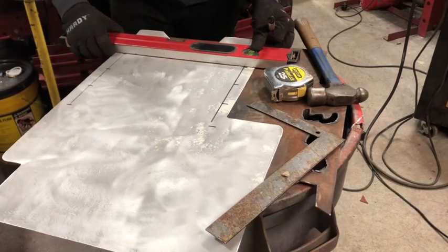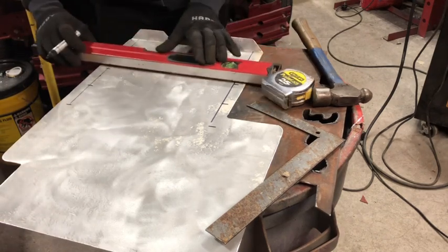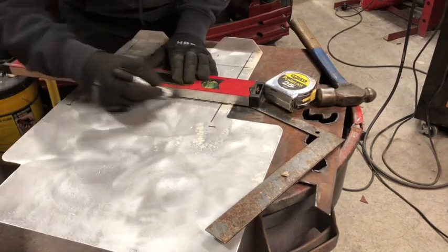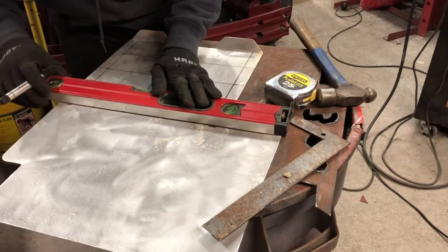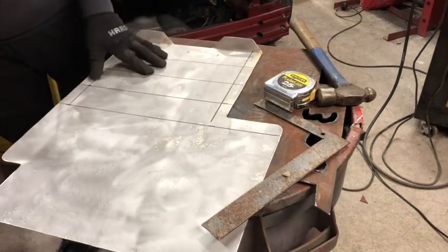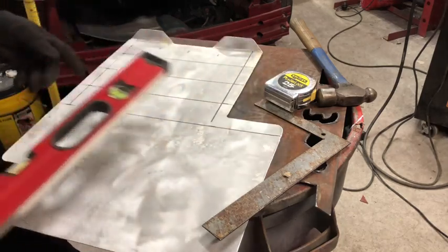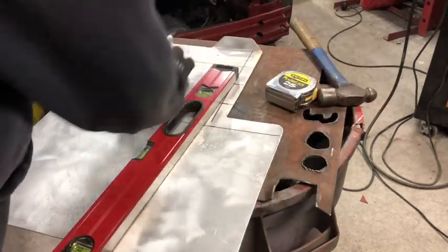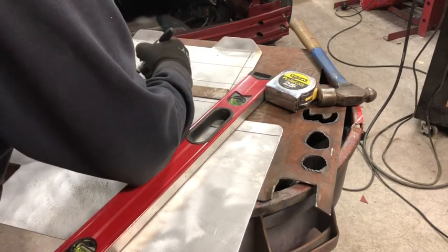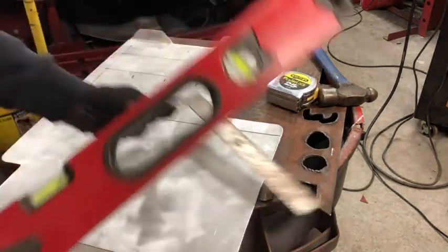So you're gonna line this up between the two marks you made and run that across. Boom. 4 3-inch on center squares. Now we're gonna go up with the same exact premise. And I'm gonna measure out this from this side here. From our line, 3, 6, 9, and then 12 is the end.